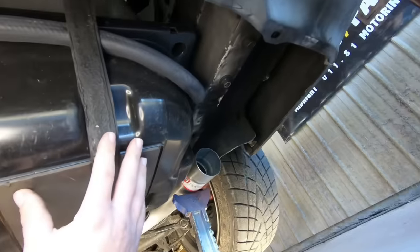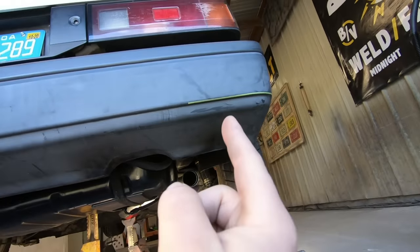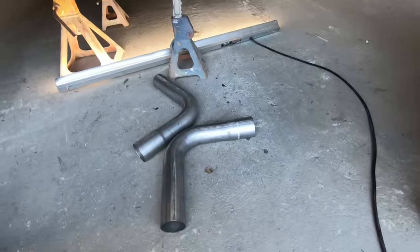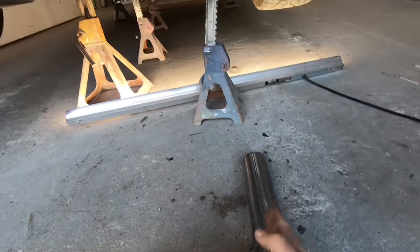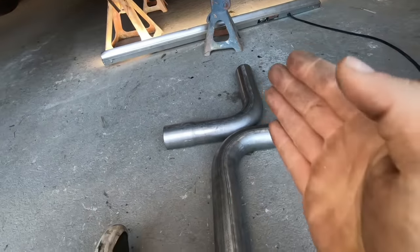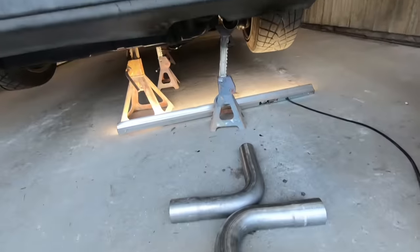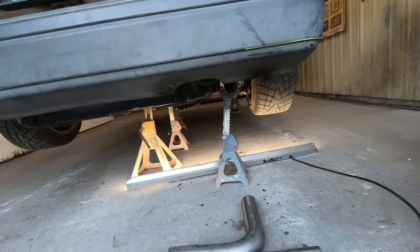This piece right here is the one we just tacked up. I connected it back to the little resonator — glass pack muffler, resonator, whatever you want to call it. That's connected, and now it's dumped out to right there. If we just had a straight come out of there it would go this way, but I want to come out of the OEM location, so we've got to come forward 90 degrees this way and then 90 back. The 90s in the kit aren't great for a tight turn like that, so I'm thinking I line one hypothetically in line with the pipe and the other in line with where I want it, see where the next two cuts need to be, and angle it up just a little bit.